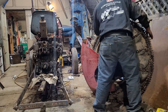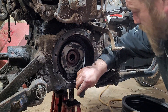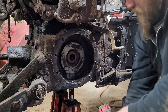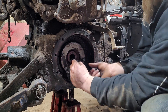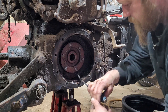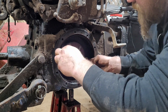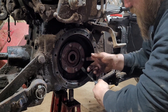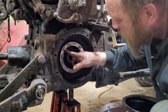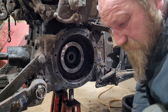The tires actually come off relatively easily even with the weight of the axle — they're heavy but manageable. Back into lock clips: you've got to get those removed, get the bolts out, and don't forget about that plate that's right behind those bolts. This is the side that we had a lot more of a leak out of in the first place. Look at that ring — it was mangled.